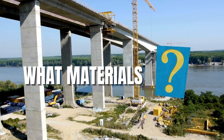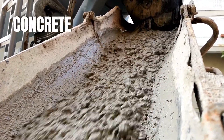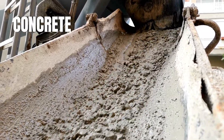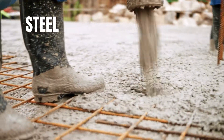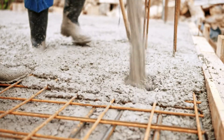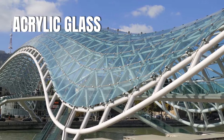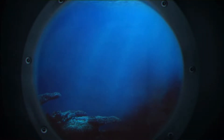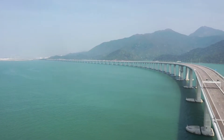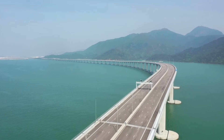What are the most common materials used in underwater construction? Concrete: a special variety used underwater is able to set quickly despite water currents and fares well in saltwater. Steel: typically enclosed by concrete, it forms a strong structure for underwater buildings. Acrylic glass: resistant to sunlight, durable, and fairly rigid, acrylic plastics are well-suited to underwater construction. Since it is transparent, acrylic glass is used for underwater windows. With the right materials, construction companies are ready to use a variety of methods to create amazing underwater structures.